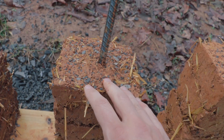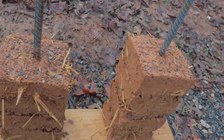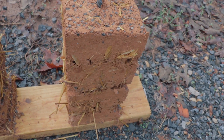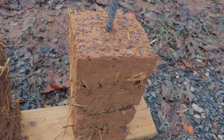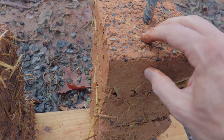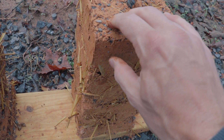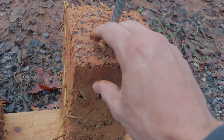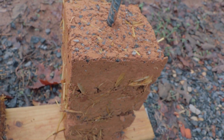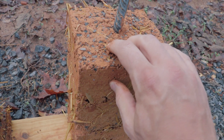There is some improvement with the 5% lime, definitely. Now going over here, we have a 10% stabilization mix — this is 5% lime and 5% pozzolan. This one is definitely the best out of the three and is definitely showing the best resistance to the moisture. If you could come and feel all of these, it would be very clear to you.